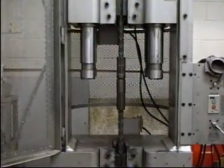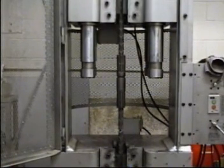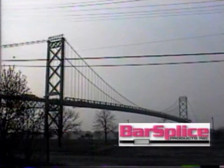The stress area of engaged threads used with grip twist taper threaded couplers is greater than the rebar. The added strength is commensurate with Type 2 performance requirements used in areas subject to effects of seismic activity or other dynamic condition. A feature is the use of rolled external threads, which inherently have high fatigue strength. This can be a consideration if a structure is subject to the effects of a continuously varying load. Bridges and elevated highways are examples where moving traffic induces varying loads into deck steel and column bars. Wind loads may be a factor for many structures, especially high-rise buildings.